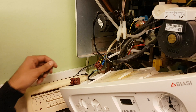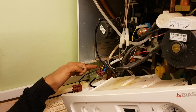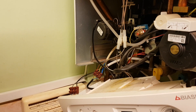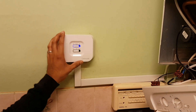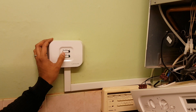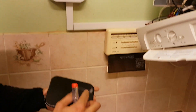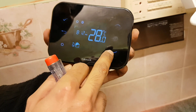These are the switch wires which normally go to the loop, so the loop goes into the boiler, and then you get your live, neutral and earth coming out from there to the receiver. You simply get those wires — you've got two coming from the boiler — and the live is powering it, so the auto function is for connecting it to the Salus wireless thermostat.